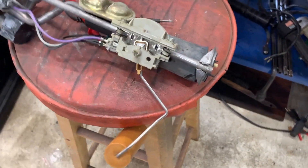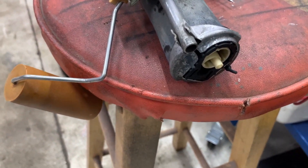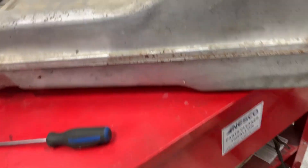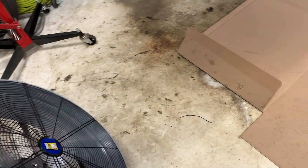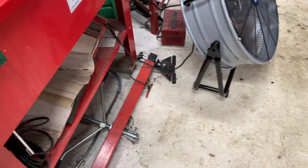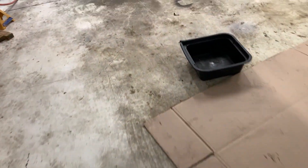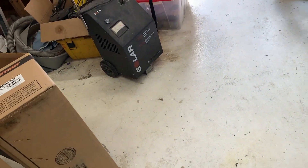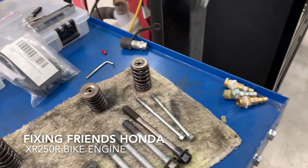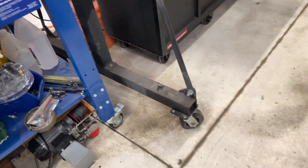Oh yeah — if you're ever inside here, it's not on here right now because I took it off, but there is a sock which goes over the end and you can get them online. It's a dirty sock — when you take them out you'll find that they're all brown and disgusting. Do yourself a favor while you're in there, grab a new one, because if those things plug up you're going nowhere — the fuel flow will pretty much come to a screeching dead halt.